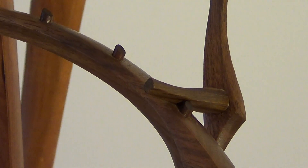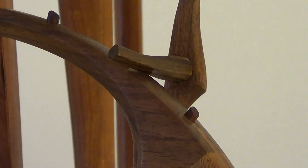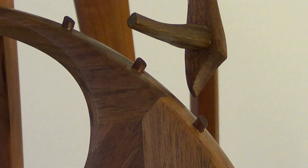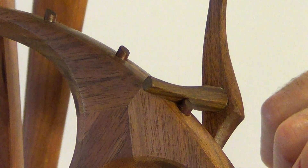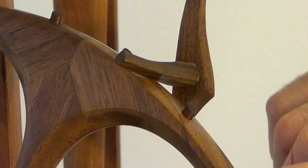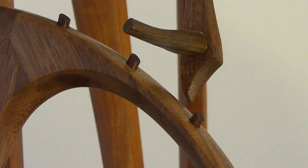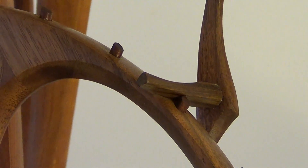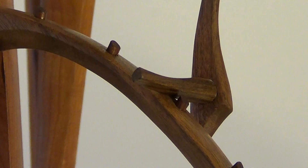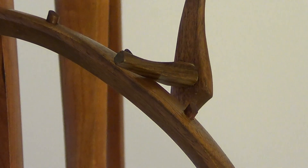I also use that type of wood in the pivots, like the little bearings on the wheels, which are also then lubricated with powdered graphite. In extremely humid weather, the only time you may want to do some lubrication is if you notice the clock — the pendulum doesn't seem to be swinging as far, and just kind of barely releases. Or maybe the clock mysteriously stops altogether.